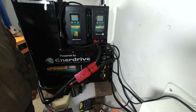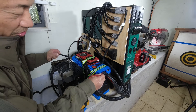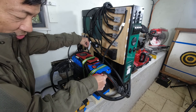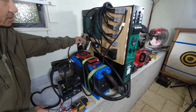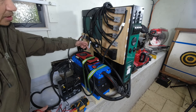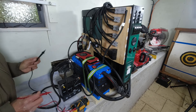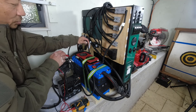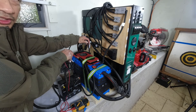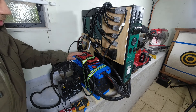That's good, but doesn't help me understand why. Now that the battery management system has woken up, I'll measure the voltage of the battery, which is now receiving solar power charging — the voltage is 12.16 volts. This is the Anderson connector for my 330 watt solar panel. Previously, when I measured across the input and output ends of the battery management system terminal while the BMS was asleep, there was no circuit. Now with it awake there should be a circuit — and you can hear my multimeter beep, confirming there is a circuit. The battery management system has clearly woken up.